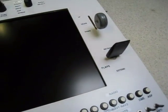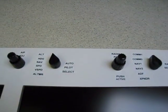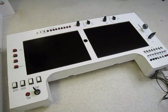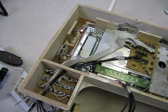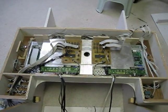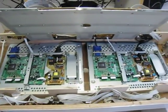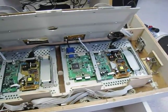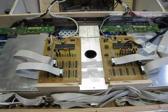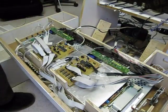The instrument panel assembly contains the controls, switches, and rotaries. It also contains the two 15-inch LCD panels that display the instruments. With the back cover removed, you can see the wiring and the interface boards. I have removed the LCD monitor housing to minimize the gap in between them. The aluminum bracket holds the MJOY16 interface boards, and the monitors are also fixed to the bracket.